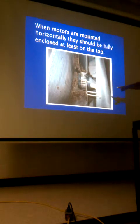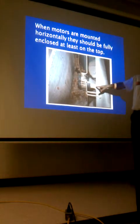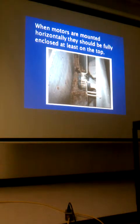Here I'm using a tape measure and marking a fan blade's distance from the orifice. There's not any specific part on the fan blade I have to mark, but I put a black mark on one fan blade. If I wanted it to be exactly one inch, I'd put my tape measure at one inch and mark the fan blade. Otherwise, I'd just put a mark and measure that distance at a specific spot on the orifice, because the motor mount might be slightly off — not perfectly centered — so it may not be the same distance all the way around.